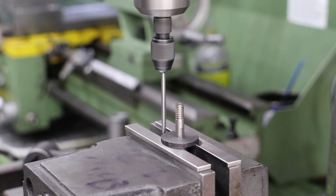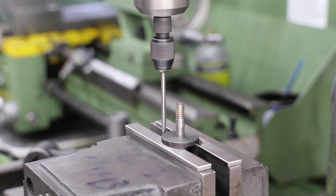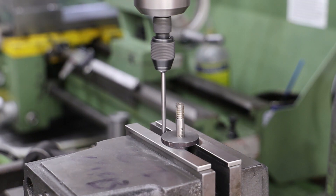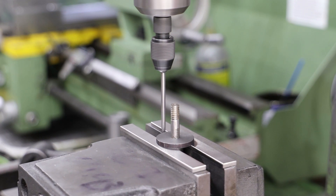Here I've got one of the covers clamped into the machine vise on the milling table, and I run into a really good example of one of the mistakes I spoke about in my last video in that I didn't plan ahead properly. The critical activity here is for me to find the centre of the gland, but when I turned it in the lathe I chose not to clean up the outside diameter of the cast iron bar, which of course is quite rough, not circular, and far from concentric with the shoulder I've turned.